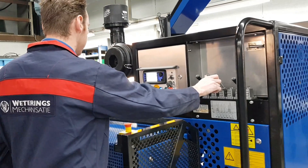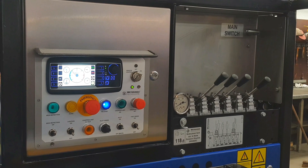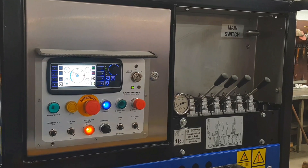In case you want to open or close the chopping unit, press the red button. Wait about 1 minute until the orange IN-OUT button lights up. When opening and closing is enabled, an acoustic signal is also heard when the orange button is pressed.